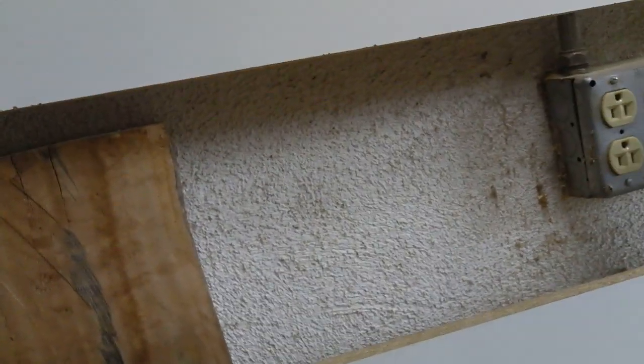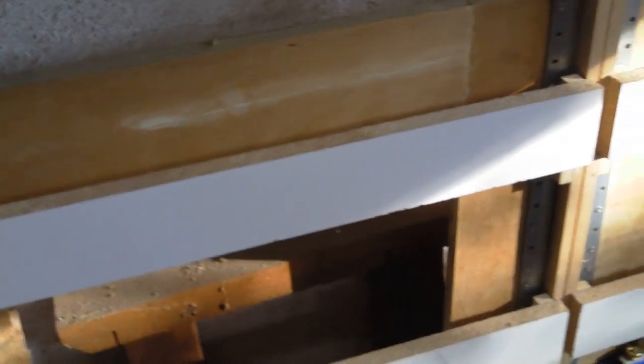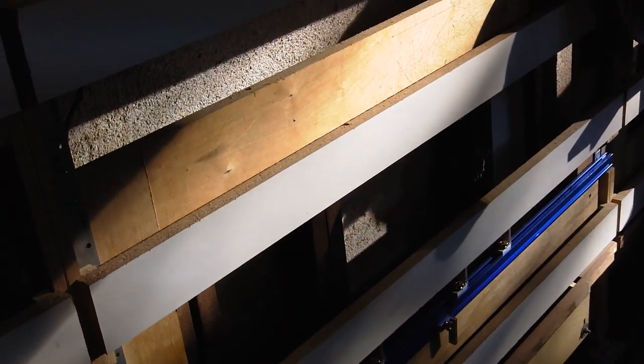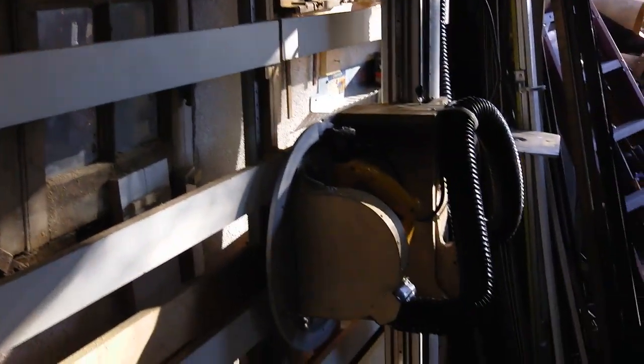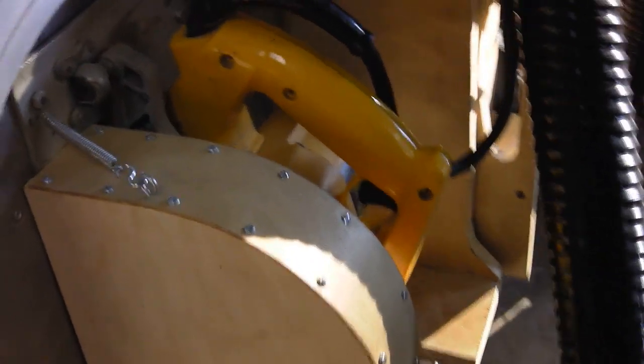As you can see, the frame has holes in it — I've got stuff stored behind it, because in my shop there's never enough room. The extrusions are Bosch Rexroth extrusions. As I said, if you buy them, you can get them in lengths of about 18 feet and they cost about $600, so those are pretty spendy. Those are the corners where they join, and I have a couple of those gussets attaching them together. It's a lot of work to make, but totally worth it to have it always ready to break up a big sheet of plywood. I'll also just cross-cut small boards with it. The dust collection is quite good, the quality of cuts in terms of squareness is very good, it saves a lot of space and a lot of time. Maybe at some point I'll drop some plans and make those available.